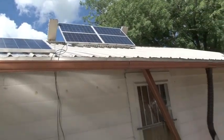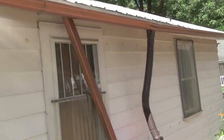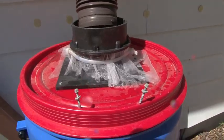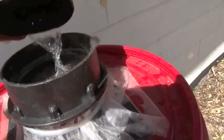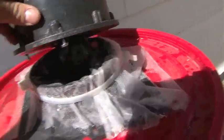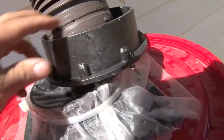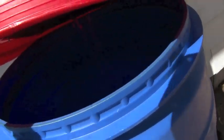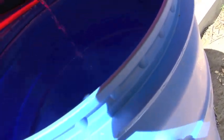From a steel roof through this one spout, into this screen — lift it up — I have a fine mesh screen. This clogs up pretty quick so you have to be diligent; really after every storm clean it out. In the barrel, I took the outflow about two inches higher so it leaves out some of the finer sediment, the dust and stuff in the bottom two inches of the tank.